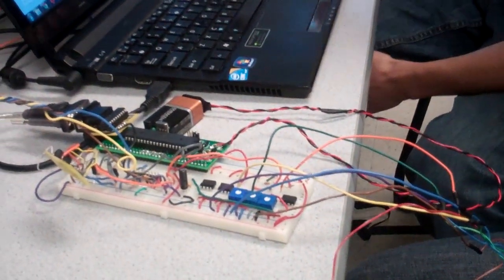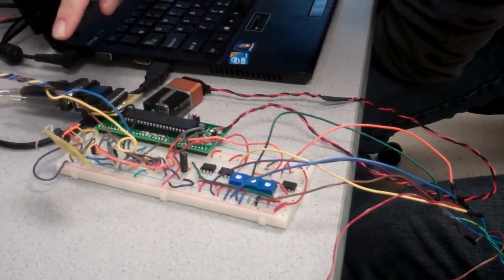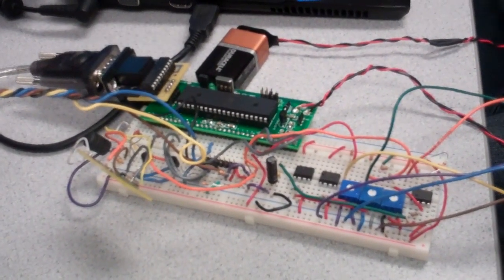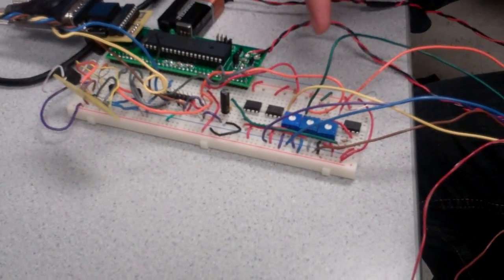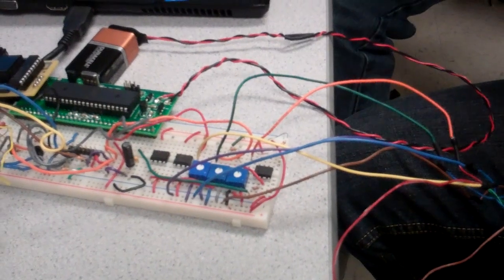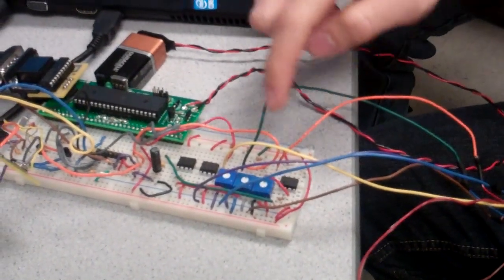Okay. Right. And then over on the microcontroller board is some amplifiers, probably. Yep, we've got the most important part of our board here, which is actually the wireless connection. The signal from the phototransistors actually just goes straight through. They're just resistors from VCC to ground, like in the lab 4 circuit. Basically, we're just looking at the voltage from the phototransistors and going to the ADC.